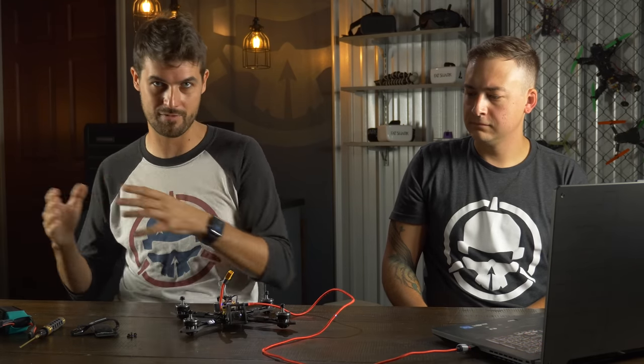For the arming angle, by default it's set to 25 degrees — the quad has to be basically flat to arm. That could be a problem if you're taking off from a hill, a launch gate, or you're crashed upside down trying to shake it loose. So we set it to 180 degrees, meaning you can arm at any angle, even upside down. It is technically a safety feature to leave it at 25, but 180 is more practical. Just be careful when arming — which you should always be.